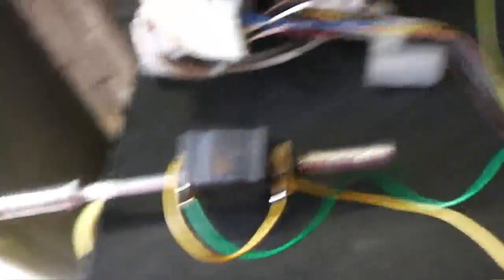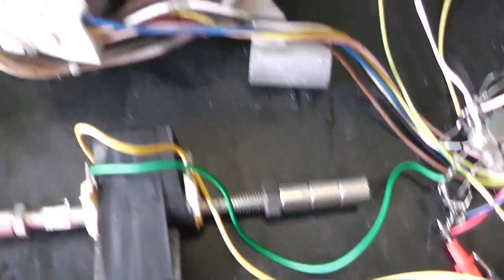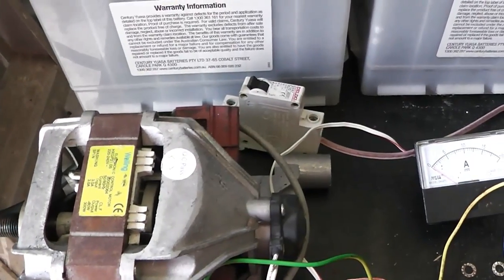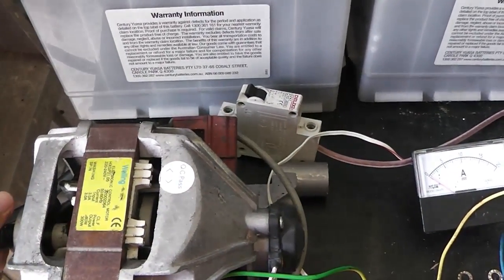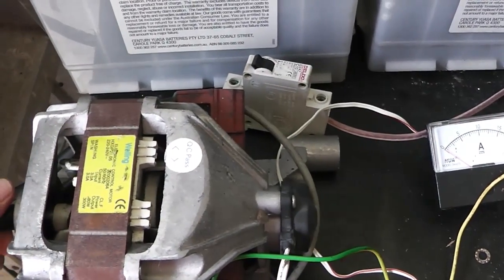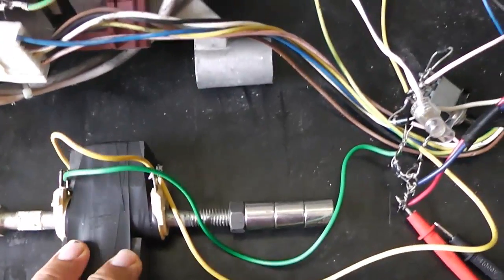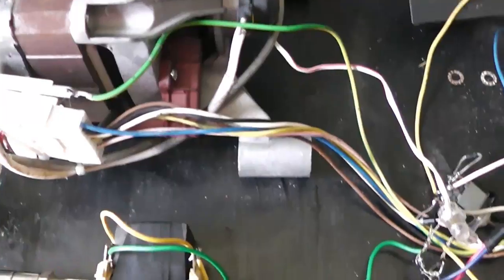This is just to show you, as evidence, what most inventions are failing on. With a motor, you want the flux to be going through the steel lamination, and you get the best, most efficient motor with the magnetic field going through and through the rotor, getting connected with the rotor's magnetic field. But with a motionless electrical generator, you want the field to be saturated through the lamination, coming out and cutting through the coil.